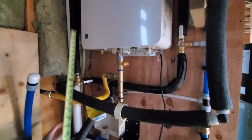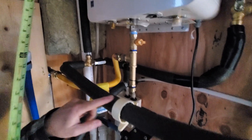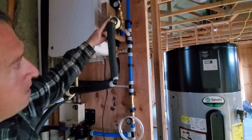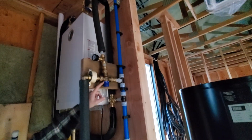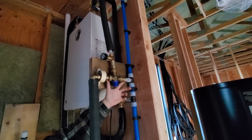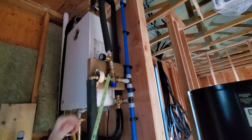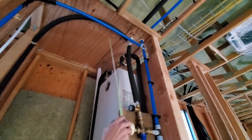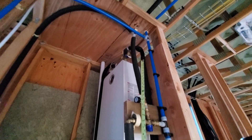This valve allows it to go primarily through this mixing valve, which you're required to have by code to ensure the water is not more than 120 degrees — it mixes cold and hot depending on temperature. Then it comes up through here and makes its way through the rest of the run, teeing to the shower and all the other fixtures we already described.